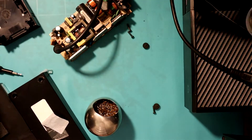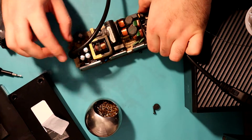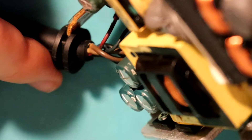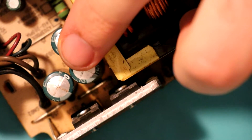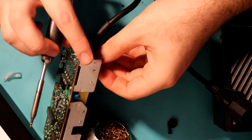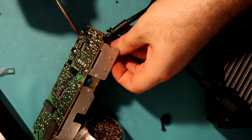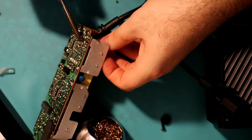Let's take a look. When I first disassembled this, I immediately noticed three issues — these three capacitors are swollen. They shouldn't be; no capacitor should be swollen like this. So now what we're going to do is desolder these. I actually have some replacements ready. I'm gonna grab the offending capacitors one by one and desolder them while pulling on them. I have identified the leads which are from the capacitors.